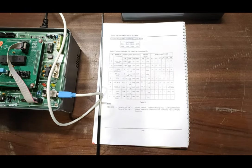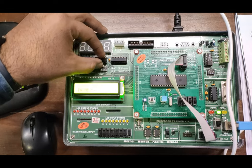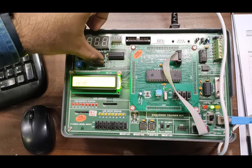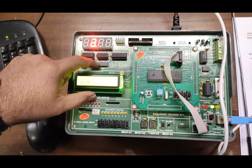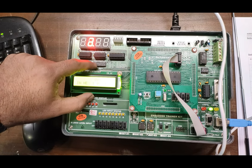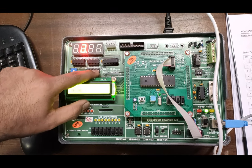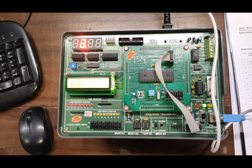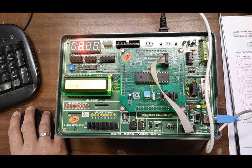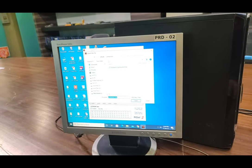As described, we have to turn on DIP switches five, six, and seven. Power is now provided to the seven-segment LED display. DIP switches one, two, three, and four are in the off condition as described for this program. Press reset once. Now we will download the program for the seven-segment LED using the hex codes already written.